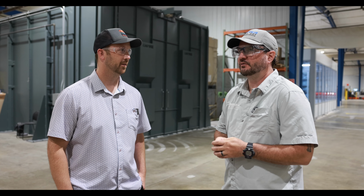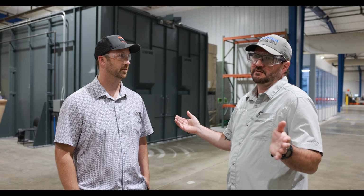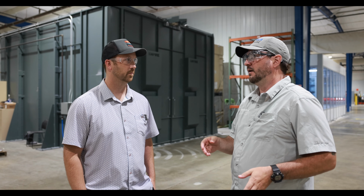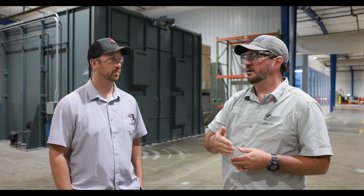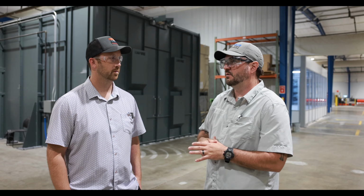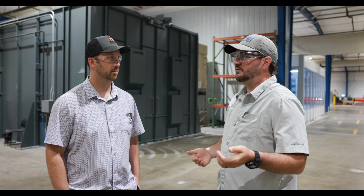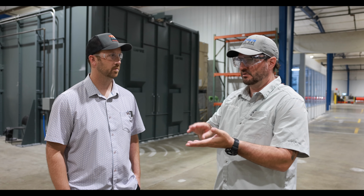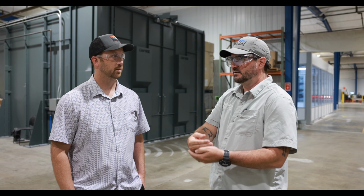It's a really long process overall for some of the large facilities, and the whole facility build outs where they're putting 15 of these things in one place. A lot of this stuff is happening so long before we've even started cutting the steel, because of everything that needs to fall in place for it to all go. But when it comes time to place your order and to take delivery, you usually want to plan on 6 to 8 months, and then once it gets to your facility, you've probably got two or three weeks of install work by your local HVAC and by your local electrician. And then at that point, we'll come down and commission it.